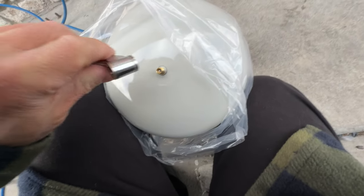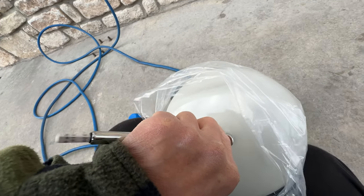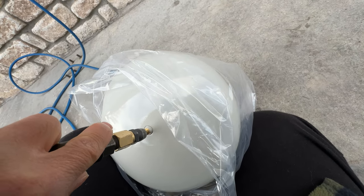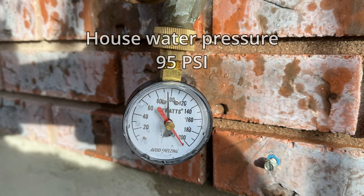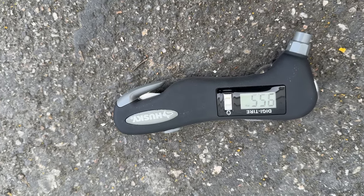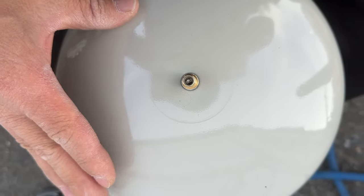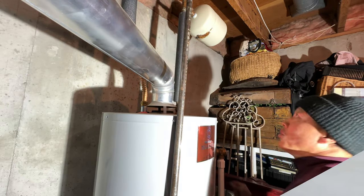Let me check — okay, it's at 50 psi, let's add more. Now it's at 74 psi. Actually, for this house the water pressure is 95.5 psi — I went to the house and checked the water pressure and it was 90 to 95. So I came back to the gas station and refilled it up to 95.5 psi. Now let's go back and install this thing.